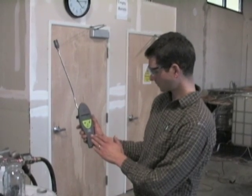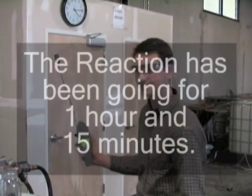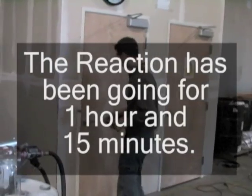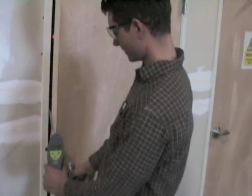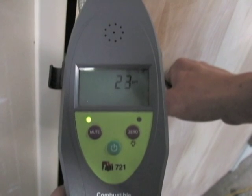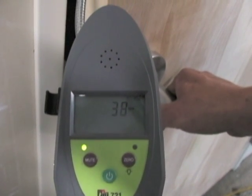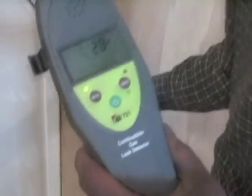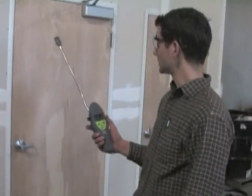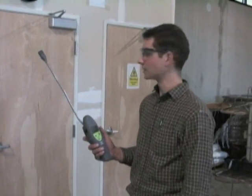To test the ability of the machine to prevent methanol fumes from escaping, we're going to see what kind of fumes have built up in the closet. We put it in there, and it's building up some. We see we're in the 40 to 50 parts per million range. That's natural and to be expected — as the machine warms up it has to release the pressure that's formed, and so there are features on the machine that allow it to off-gas if pressure builds up.